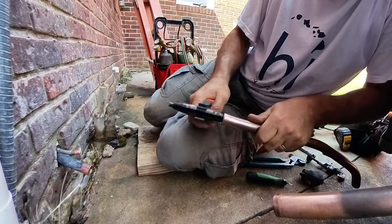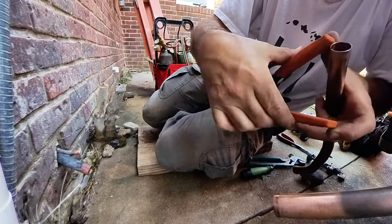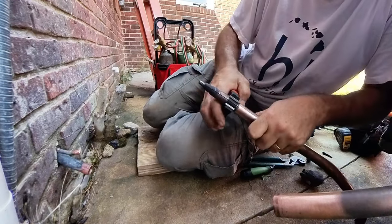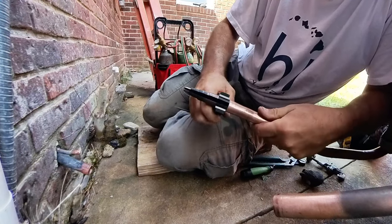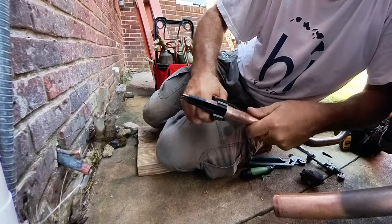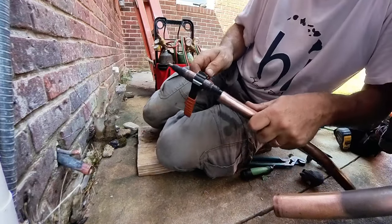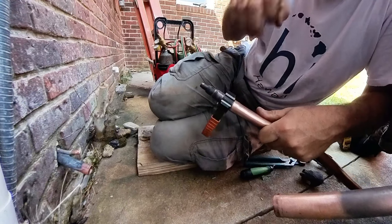You want to get this to where it's all the way. Underneath it's got a stop, and you also hit your handles — that's how far you want to go. Right now we have expanded it, but it's not enough yet. It needs to go to that next step up. I've worked it around incrementally so that it'll be round — pretty round — but not enough yet to fit on that pipe, though we're getting there. We've hit that step, now we're going to go to the last step. This is the 7/8" expander.